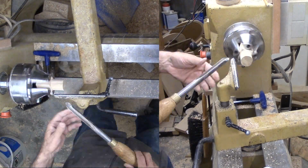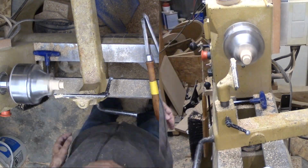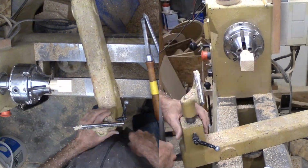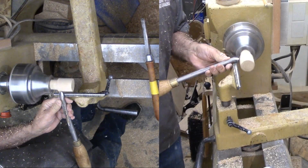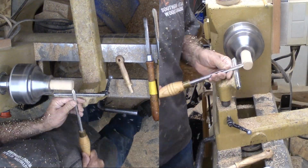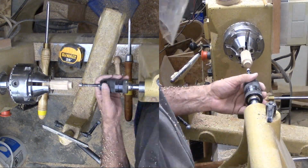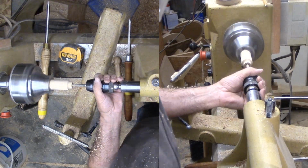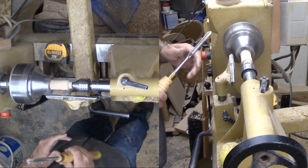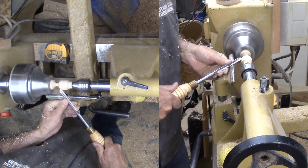I've mounted another piece of wood into the chuck. This is not a great hold because the wood is irregular, but it will be sufficient while I cut a tenon. Then I can reverse mount it so that it can be more secure. Then drill for a tenon that will connect the pieces through the plywood. Now I can finish shaping the knob. Nothing fancy here before sanding and finishing.